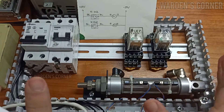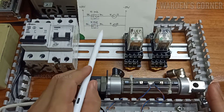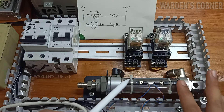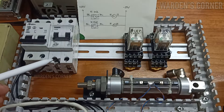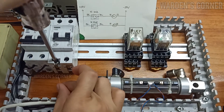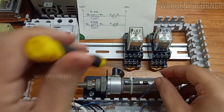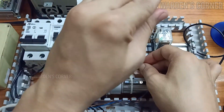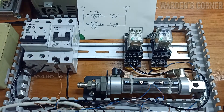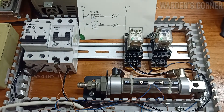Let's install. Here's our trainer module. In the wiring connection procedure, just follow the schematic diagram provided earlier. This is the circuit breaker for our 24-volt DC power supply. For control line 1, connect the brown wire from the reed switch directly to line 1 positive. Put the blue wire to number 14 of the control relay. Put a wire at number 13 to be connected to line 2 negative. For control line 2, the same wiring procedures will be made.